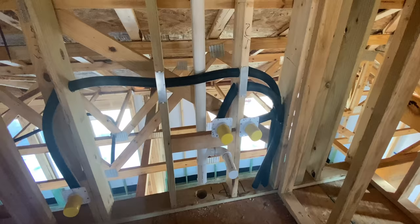Look around at what they did — this is actually a well put-in job. The vent lines, some of them are re-vented, which is good. You want as few penetrations through the roof as possible without running a lot of extra pipe, but this is actually a good job. If you're a plumber and you've seen what I've seen here, what do you think — could they have done anything better? Any tips or tricks you'd give a homeowner? I'm Roger Wakefield, the Expert Plumber. I'll see you in the next video — if you don't get flushed.